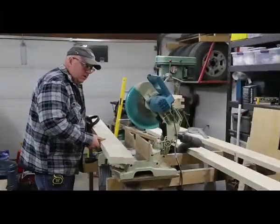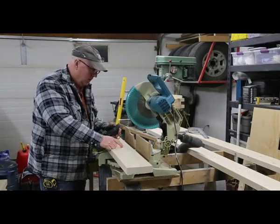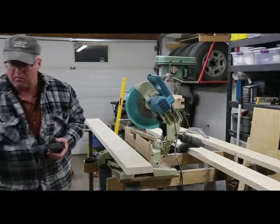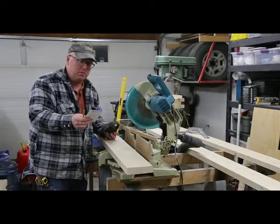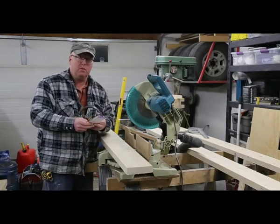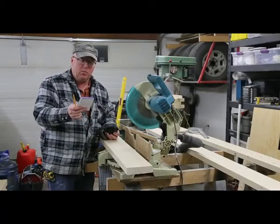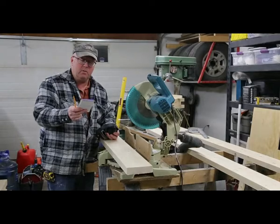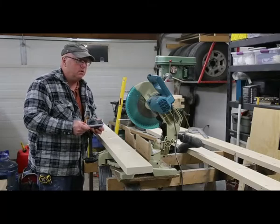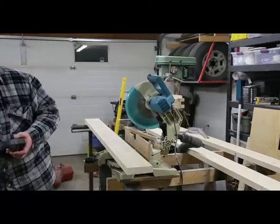All right, first thing that we're gonna do, of course, in our little growing box, like that's what I wanna call it, we're gonna cut up our wood. So I need, for just one level, we're gonna do it two levels probably. I need one at 24, because the box I'm gonna build for my specific little spot is 24 by 21. So I'm gonna need one at 24 inch, two at 19 and a half, and one at 21. So let's get those cut, and then we can go on to designing the slope and everything else that goes on top. All right, it's gonna get a little noisy.